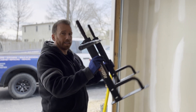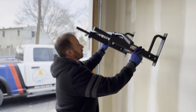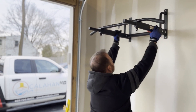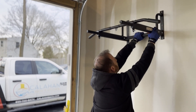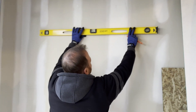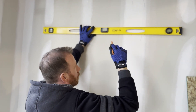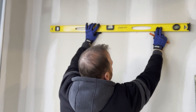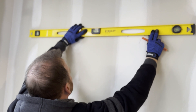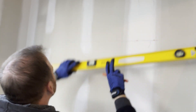The first thing I'm going to do is find the height that I'm going to put this at. Easiest way — if you see the holes in the pull-up bar, I'm just going to set these on the wall, side to side where I'm comfortable, which seems to be about right here. Height-wise, I like it where it's at. What I'm going to do is essentially mark holes. Now that I have my mark and where I want it — which you can see is right there — instead of trying to hold that pull-up bar up and get an even mark somewhere else, which would not be level, I'm just going to take that one mark, find the center of it, and draw my level line across.